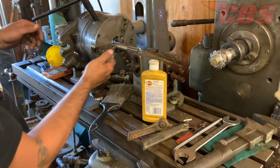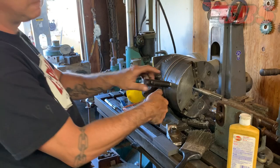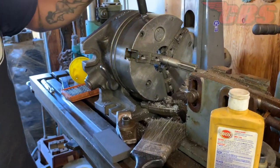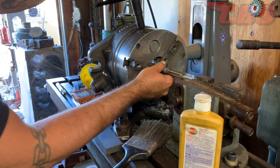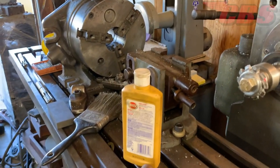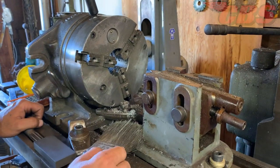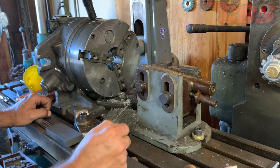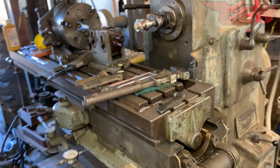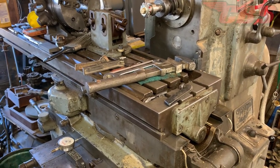The Hartford indexer is pretty popular — you put a masking plate in the back so it's foolproof. There's no dividing or anything like that; it's real quick. The rotary table can be used vertically or horizontally. There's also a tailstock to hold the opposite end of the part — extremely universal, with angle movement and clearance on top for the cutter. This machine runs a few times a month at minimum, doing a lot of heavy spline cutting.